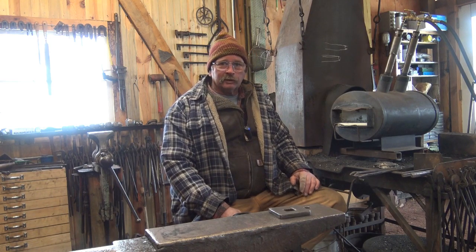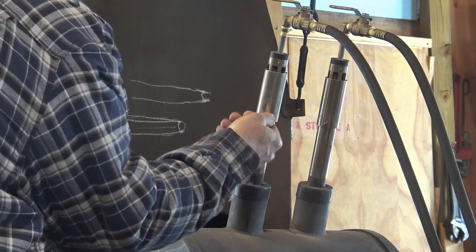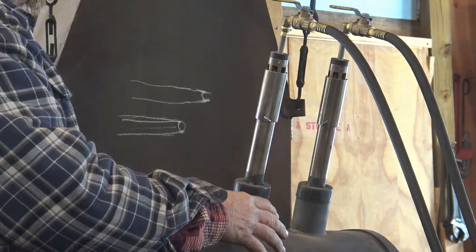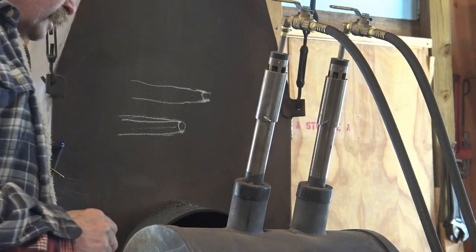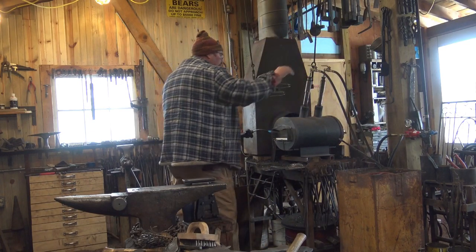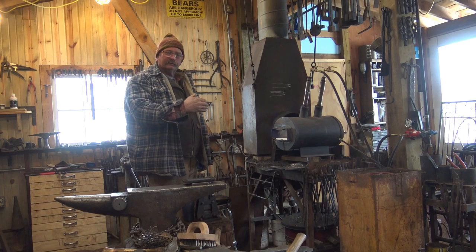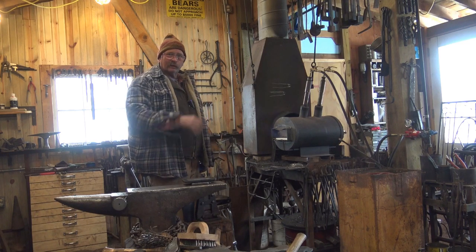Other than that, yes, you can weld in a gas forge. You have to learn on your forge what to set the chokes at. On this one for welding it's right about here — I can get a little higher heat if I open them more, but it oxidizes more, so about a half inch is what I use for welding at about 20 pounds of gas pressure. I usually start the forge at a little lower pressure even though I'm going to weld — I like to bring it up to temperature slowly, do a little bit of forge work, then bump the pressure up to get to welding heat.